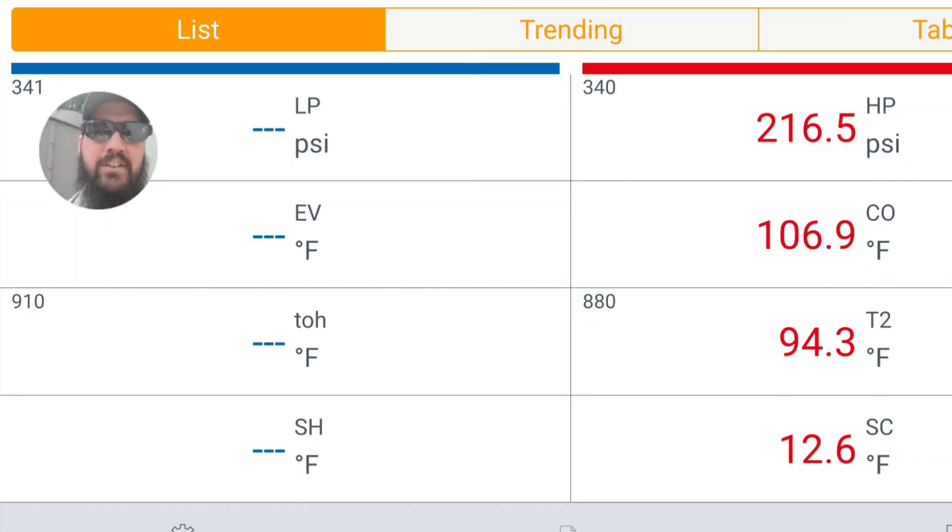Our problem is those relays. I've worked on these long enough — just take my word for it. If the fans are good, they're not having issues, and you turn it on and you're not seeing immediate head pressure problems, 90% of the time the compressor control relays in the main panel at the bottom — that's going to be your primary issue. We're going to condemn those. Let me call the customer and let them know what's going on, and we need to go look at that other chiller — it should be back online now.